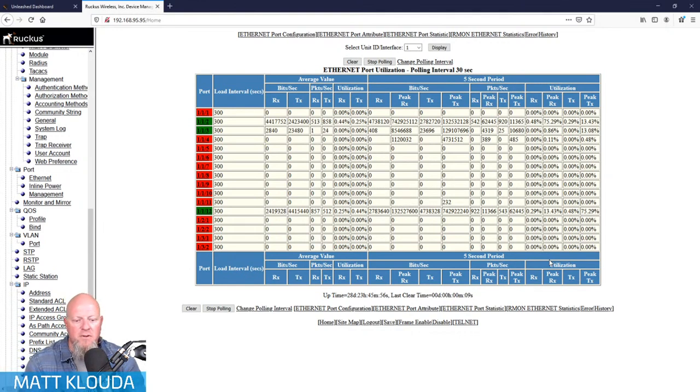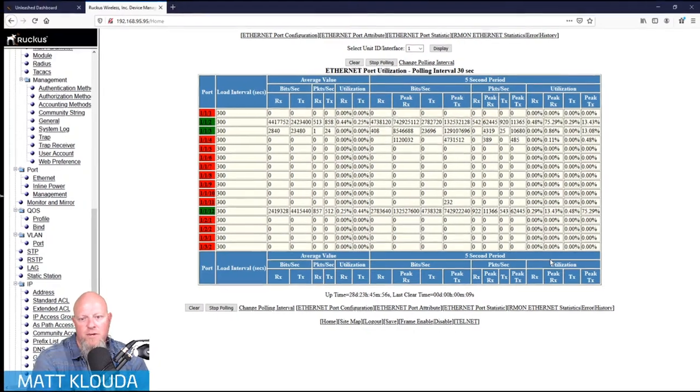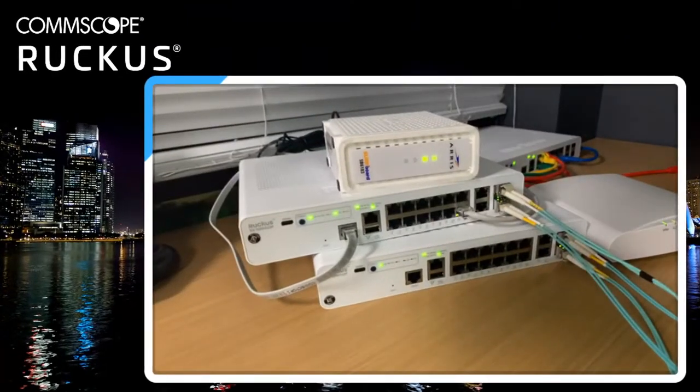So, Lewis, the thing I can tell you and the thing I'll show you is I'm going to show you a picture of this real quick. Okay. There's your ICX. There's your access point. The main challenge you have is the access point that plugs into the ICX. The ICX is providing that access point power. The cable modem can't do that. It doesn't have a way to provide power to it. Okay. No matter if it has one port, two ports, or four ports on it, none of them provide power. It's just not what they're made for. So you can plug them in directly. They just won't be powered. You'll have to have an external power supply for that access point that you plug into the wall, then plug into the access point, and it'll function perfectly fine. Okay. But yeah, you can do it. You just need the extra power supply.